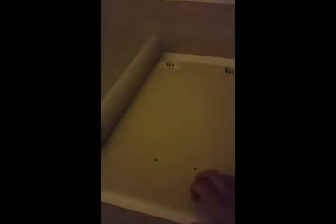I'm going to show you how I measure this out. I use something to hold the paper in place when doing my measurement so it doesn't roll back up. I have my door placed on top of the wallpaper now. The easiest way I found to do this is to take the paper, lift it up, and give yourself enough measurement to just touch the very bottom of the door. Then I'll take my pen and mark all around the door, and then show you what I do from that point forward.